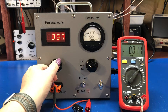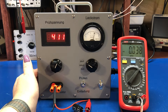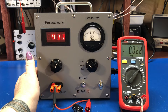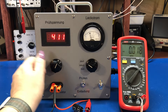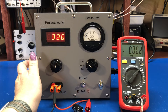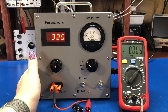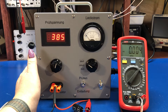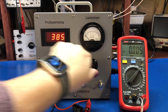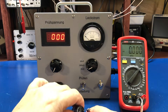If we put this up to our max range, this is looking at tens of microamps and we're at 20 microamps. We're down at like four microamps, which for an electrolytic capacitor is perfectly acceptable. This is what you would expect to see from a new electrolytic, or just a good one.